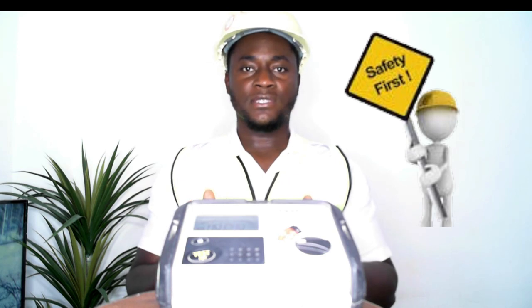So if we are carrying out insulation resistance tests for a 240 volt panel board, we have to apply 500 volt DC to the circuit. This is the amount of voltage being applied to the circuit, so we should take precautionary measures while carrying out these tests.